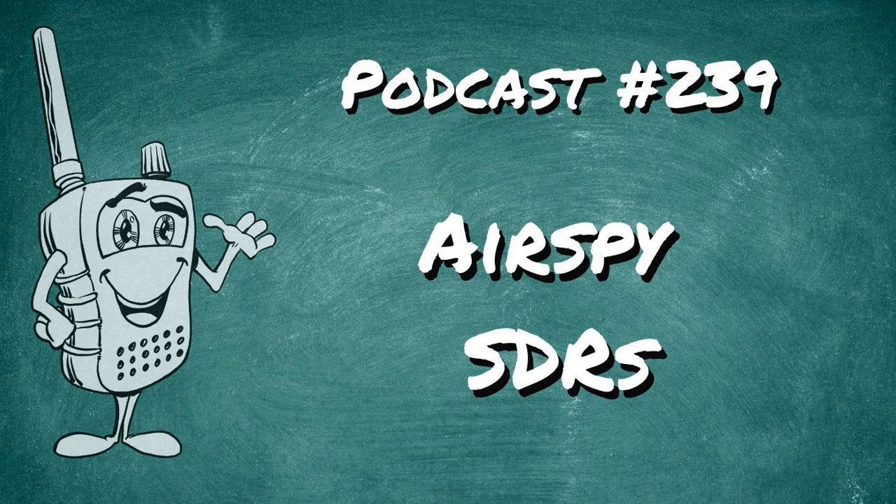The R0 and R2 are pretty much identical — a square or rectangular box with a full aluminum enclosure. There's an SMA connector on one end for your antenna network and a USB micro input on the other end, so you do need a USB cable to use the AirSpy R0 or R2. The AirSpy is also firmware upgradable, so if anything ever changes you can fix it with firmware. What's really sweet is the 0.5 ppm TCXO built in, which means you should not see drifting at all. Once calibrated — and it comes calibrated from the factory, saved in a separate part of the chip from the firmware so you can't accidentally erase it — you should be rock solid steady with this device.